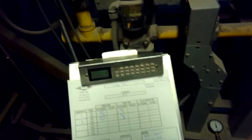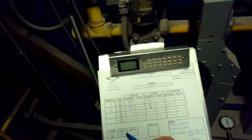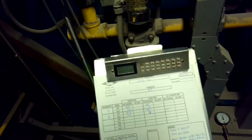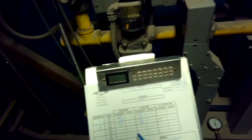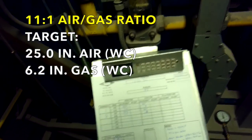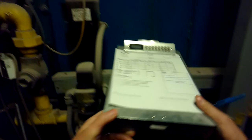We've already done the calculations. We know we want to be 25 inches air and 6.2 inches gas — that's our target to get an 11 to 1 air-to-gas ratio. I've turned it down so we can talk and keep CO levels down with the door open. So 25 and 6.2 is what we're going to set it at.